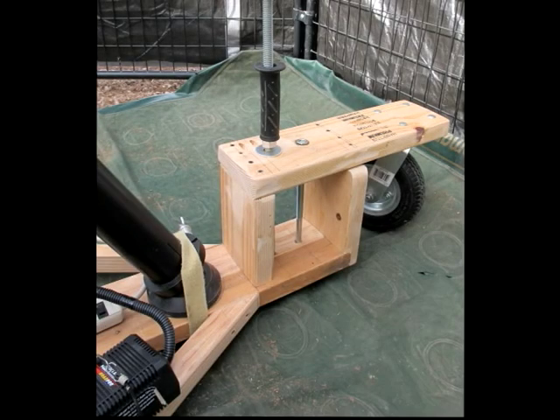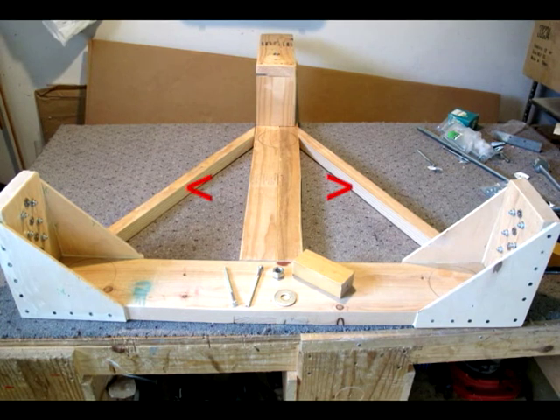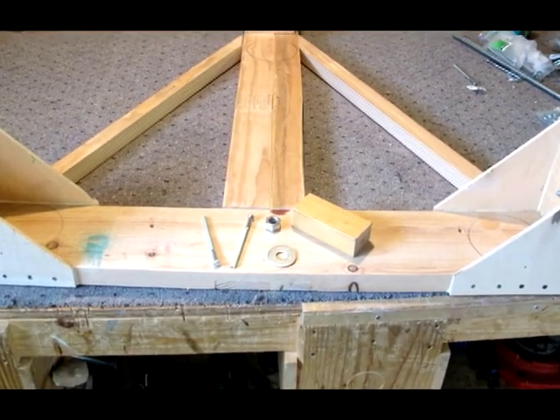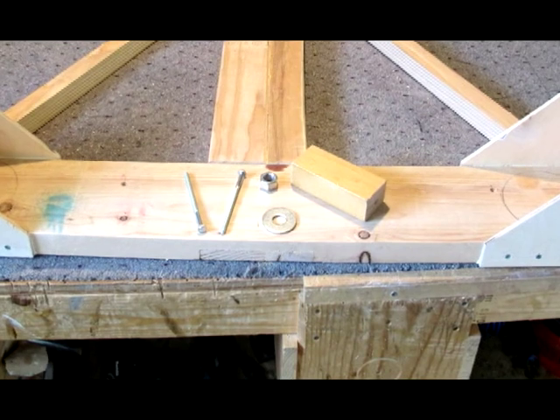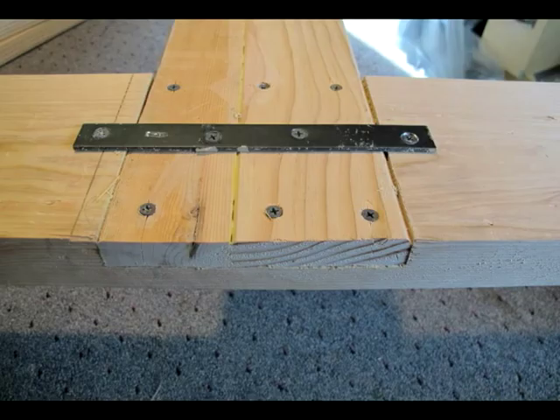The front end is strapped in with velcro. The platform bracing is made out of two-by-six ripped in half. There are no nails used in construction — all connections are glued and screwed. The two major sections that make up the buggy platform are shiplapped at the point of intersection, and a metal strap is applied to the underside.